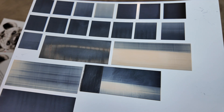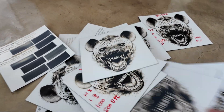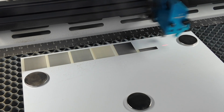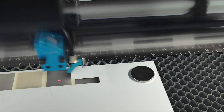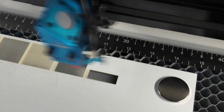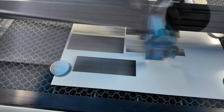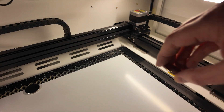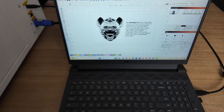Here you can see a lot of tests I did — it was madness, and that was even half of them since I threw the other half away. You can see the different blocks, the different heights, the different DPIs: 400 DPI, 500 DPI, 600 DPI, power at 18%, 90% power, z-axis at 1.4. I realized it was better to go more into focus — it had more of a matte black finish, and any small problems wouldn't be as visible. The magnets also made a big help in keeping the material flat.